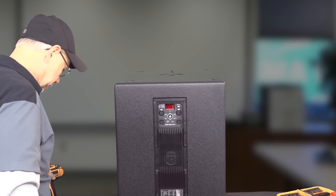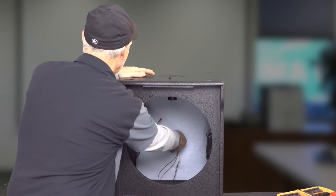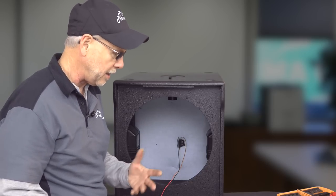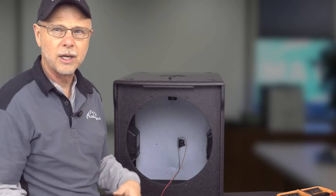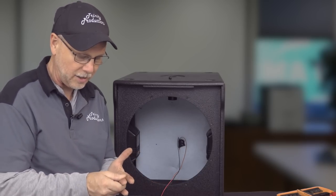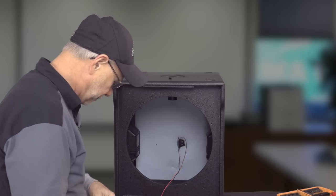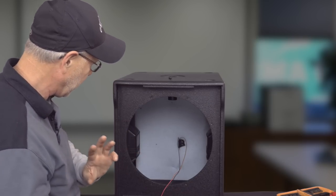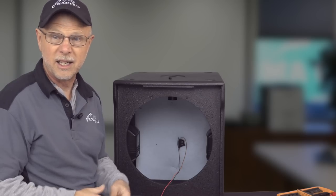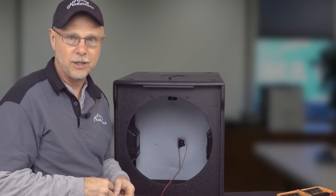And we are in. And we rotate this puppy around. And there's our cavity for the speaker. So quite amazing what they've been able to do with subwoofers now in the tunings and the way that speaker technology has come along and what they can do with magnets, getting into the neo magnets and reducing the size and keeping the effect of Gauss of the magnets very strong and the magnetic field to be able to do what that voice coil needs to do under power. So with that said, we're going to go ahead and get this speaker back in. We'll get the grill back on, and then we'll get the Mac Pro out and get Smart fired up and take a listen as far as some response curves and things like that of what this RCF 905AS Mark II can do.